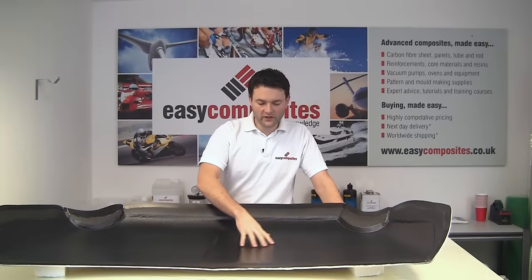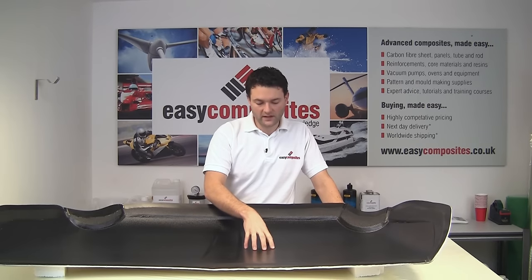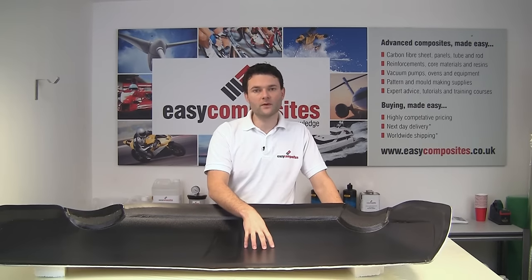We've now allowed this gel coat to cure fully overnight. Now, unlike a conventional polyester gel coat, when this cures, it cures with a hard finish and no tack at all, and that leaves the perfect bonding finish for the epoxy resin.